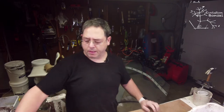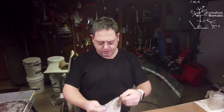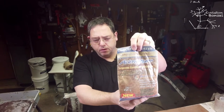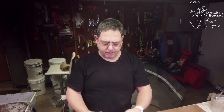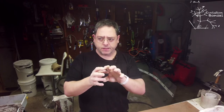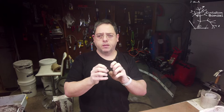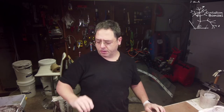And one more thing that I use is this admixture. It's an entrainer that traps micro air bubbles inside the cement, and with that it is further protected from freeze-thaw, because you can imagine that a micro crack, once it gets to a micro air bubble, the tension of that crack gets released and it stops there. So this is how that works.